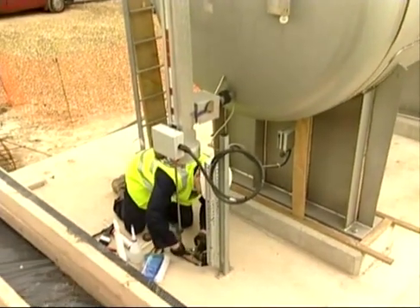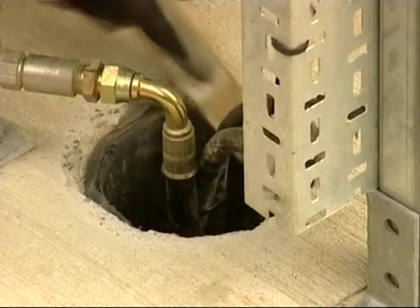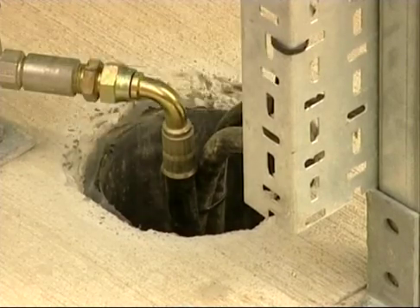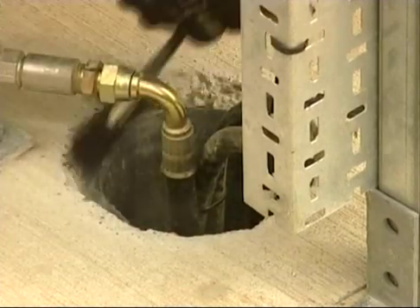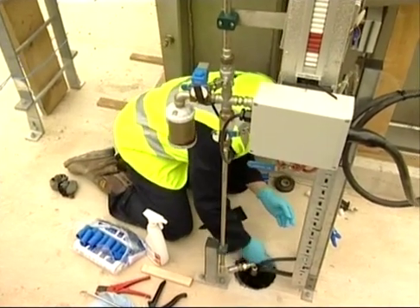This next example is into concrete. The penetration is first cleaned with a stiff wire brush and then a paintbrush to ensure there's no dust to impede the sealant. Wear stout gloves for this part of the process. After a change of gloves, the cables and pipe are cleaned.